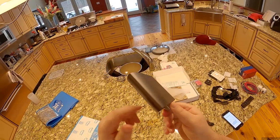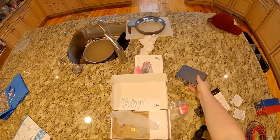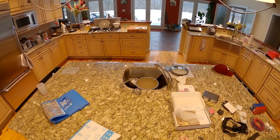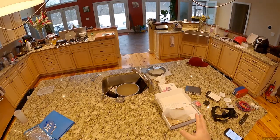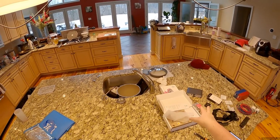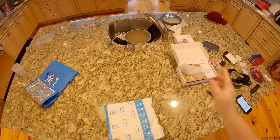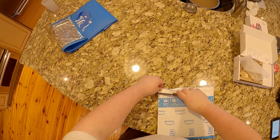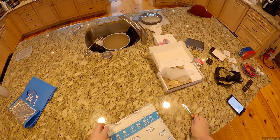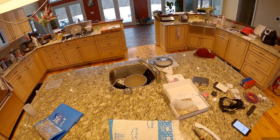Never plug in very cold electronics. Even just being in the house, forget about turning them on — condensation is forming all over the entirety of that, and you don't want that, that's bad news. Let it come to room temperature, preferably slowly. It might be better to keep it by the front door because it's been outside in like 22 degree weather.